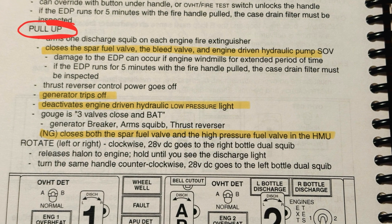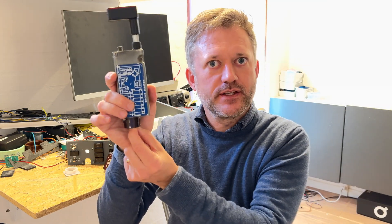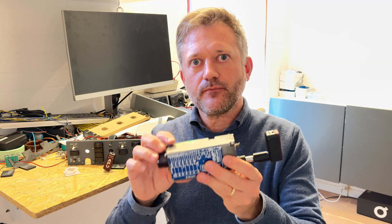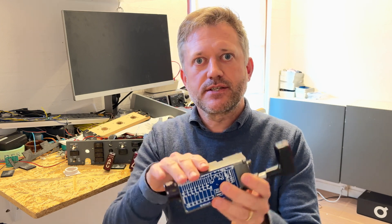Pulling up the handle affects a lot of different systems in the aircraft. In the Boeing 737 you have one wire going directly from one place to another. If seven systems need to know the handle is up, you have seven wires in and 14 wires out — one saying up, one saying down. For interfacing with this in your cockpit, you can just use pin 5 as ground and then pins 4 and 6 to tell your system if it's up or down.